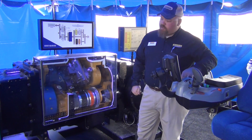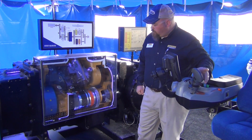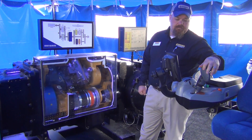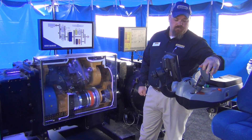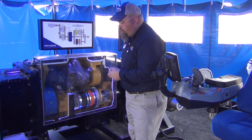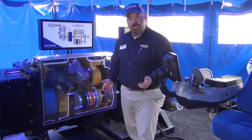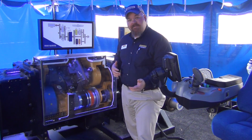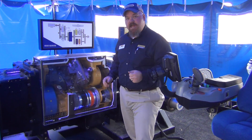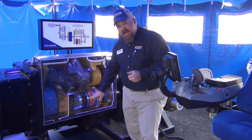Let me go ahead and start the tractor, and I'm going to call for forward. As I've called for forward, I'm now in our active stop start. This is unique to New Holland in that we pressurize the transmission so that it does not move. We don't have to use a brake, put it in neutral, or put it in park. The transmission is ready to go — it's pressurized. As you can see, clutch number one is energized but is not moving.